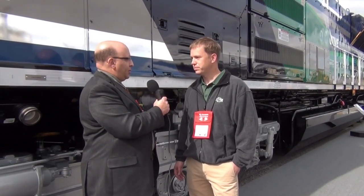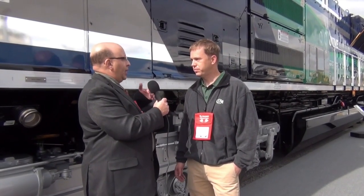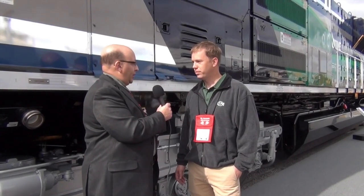What's different about the 1010 as compared to the 710? This is a four-stroke engine compared to a two-stroke engine. We have a common rail fuel system, which was also a new feature on the locomotive. Our turbos — we've designed them in-house; it's our own design as well.